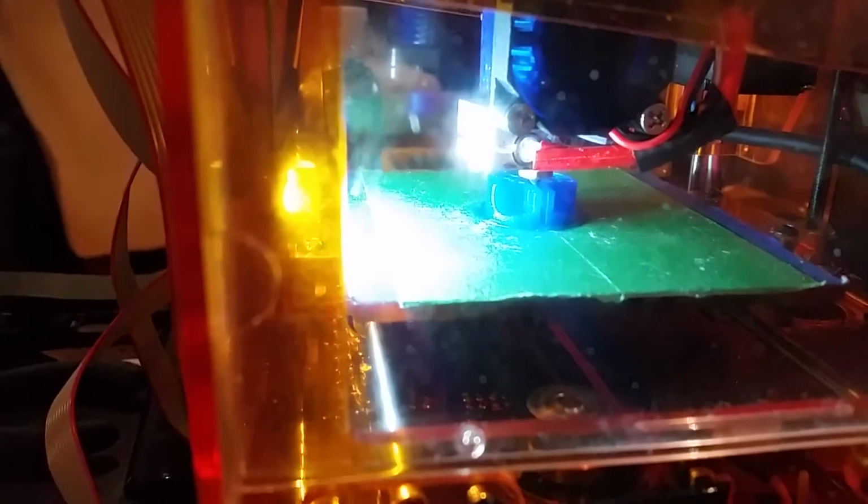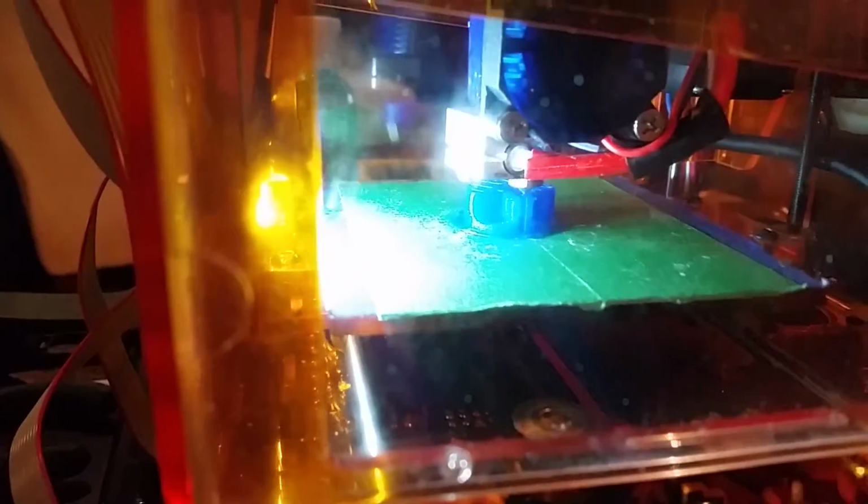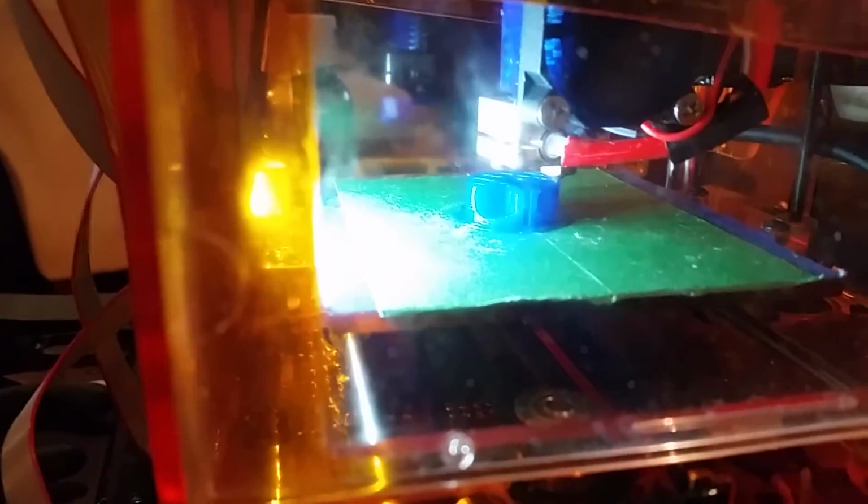So all I could think to do was to put a bit of a drill bit down with a very sharp edge and see if I could put a chamfer on the top of that little Teflon tube or whatever it is in there. It seems to have worked because this blue filament loaded easier than my filaments had loaded in the past. But I guess the real proof in the pudding is how well it flows, and again how easy I can get it back out. But it's been a while since I've had a jam that bad that I had to take the whole hot end apart. And again, that's PLA. Anyhow, I will come back a bit when this part's done.